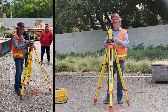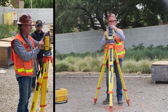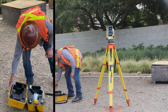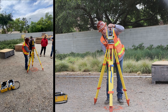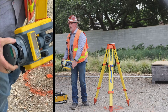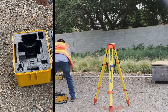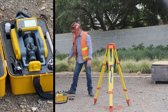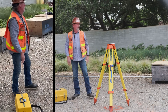When we go to put this away, we turn it off, unlock our scope, flip it up, and lock the scope. We'll open our box and make sure we're ready. Grab it by its handle. If you look underneath, you can see two orange dots — get those lined up, bring your Theodolite over, and set it down in the box. It fits right in. You don't have to sit there and try to spin the base. Make sure you close your Theodolite box at all times — never leave it open. You're good to go.